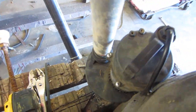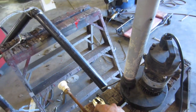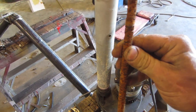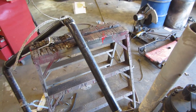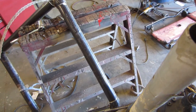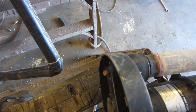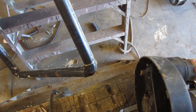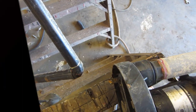I've made three holes here in a triangle and tapped them with a quarter-inch tap. You put a little quarter-inch bolt in there and the bolts hit the threaded rod to center it, so you can move your rod one way or another so you don't have all the water coming out one side. Drop that in, find that little hole at the bottom, and screw that in because it's threaded now. Put a nut on the bottom and that will tighten up against the bottom housing, keeping that threaded rod from going up and down.